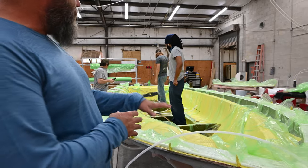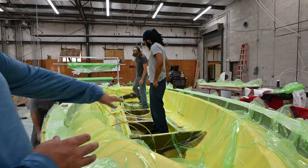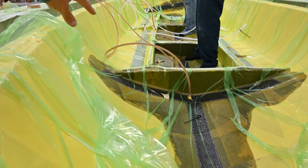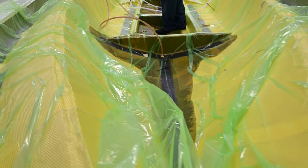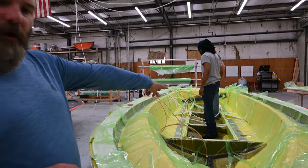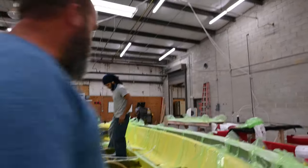This is a Carbon X7. You can look through here and see the resin moving through the part. We open all the resin feed lines on a schedule — you can see how the outside ones are not open right now. We'll open those as soon as resin starts to hit them, and then it'll fill the whole boat up and come to the top.